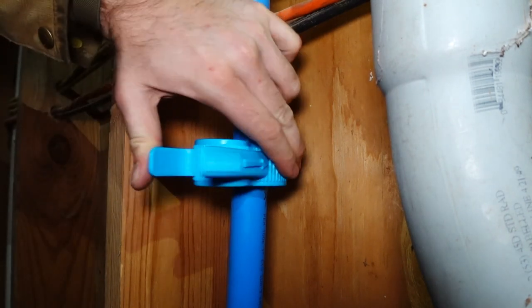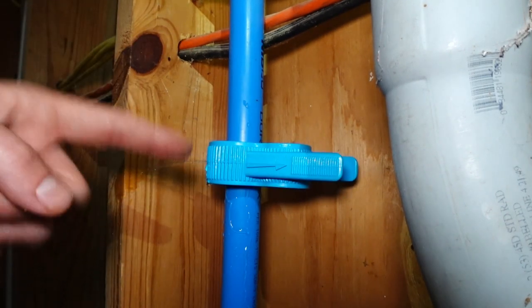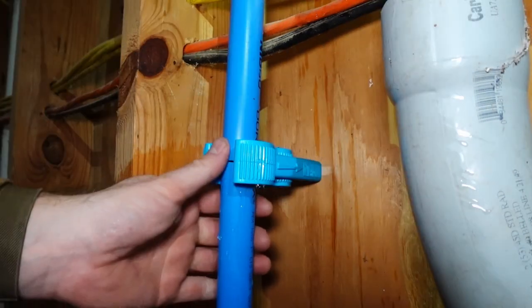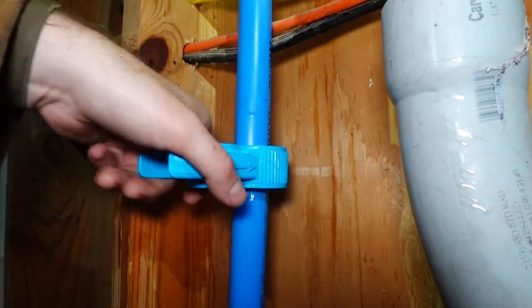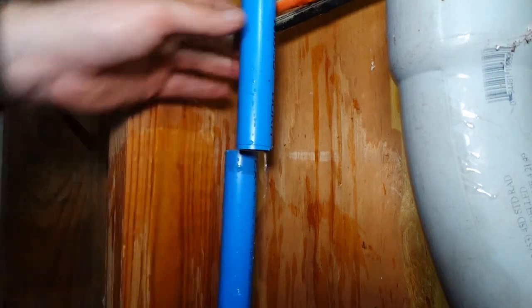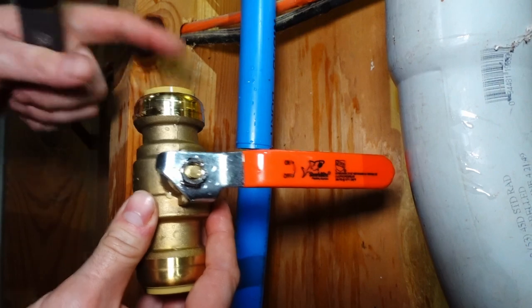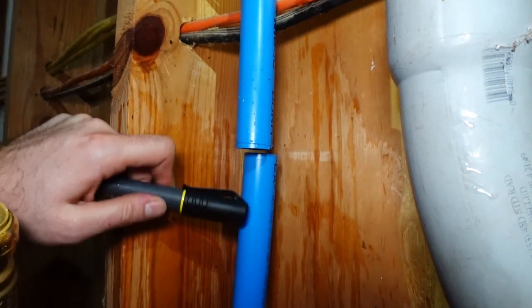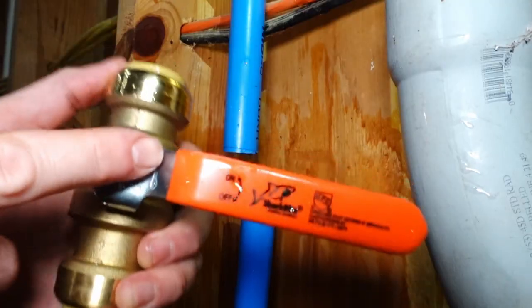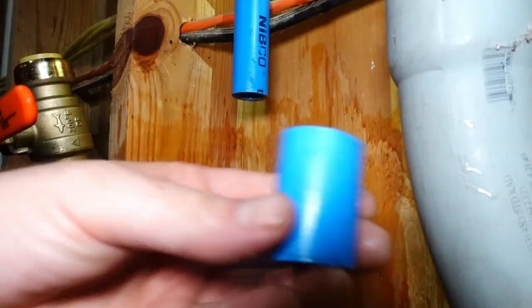It is on. We have some water coming out — it's probably the water held in the system. I'm going to let this drip for a second so that as I break the line all the way, it doesn't just explode everywhere, mainly onto the camera. We let the pressure out of that line so it wouldn't make our lives difficult. The cutter did seem to go all the way around. You can imagine there's a lot of water in the system — we have a bathroom upstairs, so any water held in the line needed to get out of there. We're going to need a little bit of slack on the ends, a little extra pipe on top and bottom, so we can get these in there. I'm going to cut the bottom a little further down and mount it down here. You can see the little razor blade inside the cutter. On here it marks on and off, so we want this oriented so it's not trapped up against the wall. There's the piece that we removed.